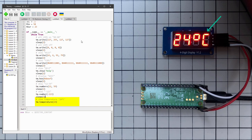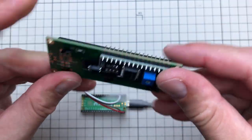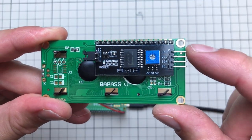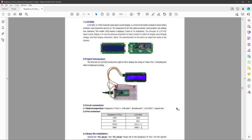One minor note is that the temperature function only shows degrees Celsius, not Fahrenheit. Let's move the 7-segment display aside and move to the next one — the 16x2 character display. On the back there's another board soldered in, often called a backpack, which enables I2C connection: only four wires instead of many for parallel communication. The first lesson using this display is lesson 22 called Billboard, which scrolls text across the display.